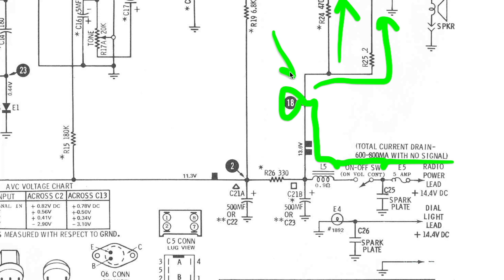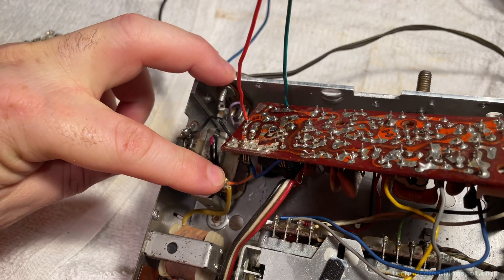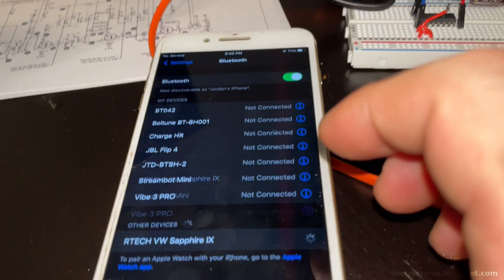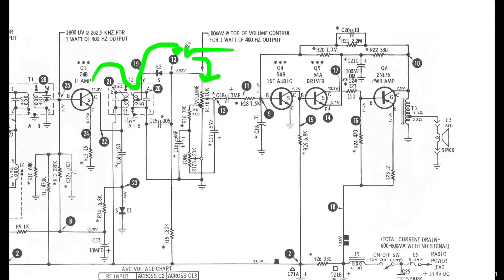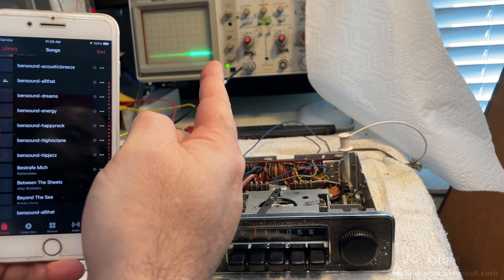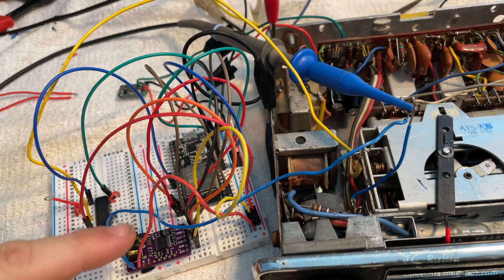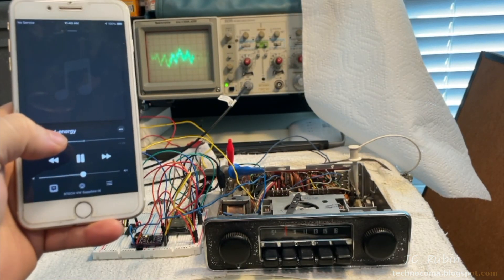We selected a nice point to connect our voltage regulator, tested out our regulator within the radio, moved our power source to a presence off the circuit board, came up with a wiring convention to incorporate our multiplexer, digitized my voice and programmed it for tactile feedback on connection and disconnect of the Bluetooth, found the proper location to tie in our mux output within the radio circuit, tested the mux cutout by bypassing the AM and seeing it latch back on on audio disconnect, prepped the DAC for output signal connectivity to the mux, assembled our complete path with both inputs and one output, and finally tested the complete project with a cut-over from AM to Bluetooth by running audio through.